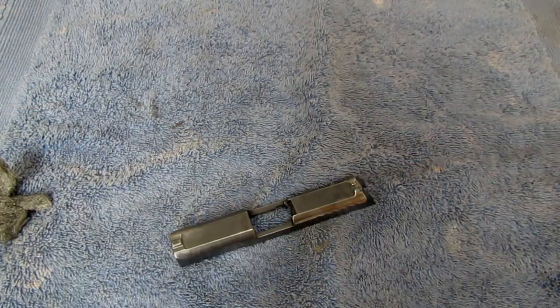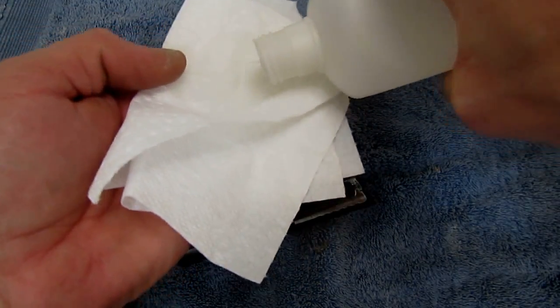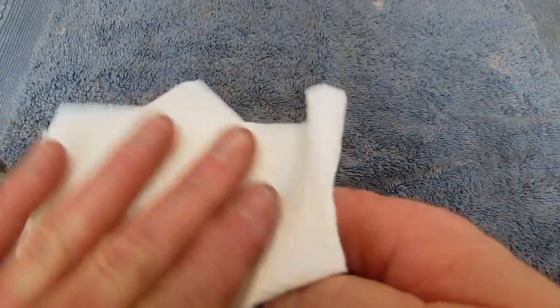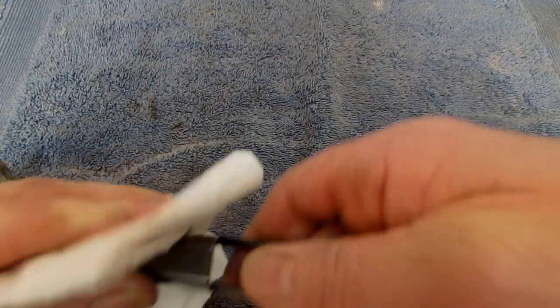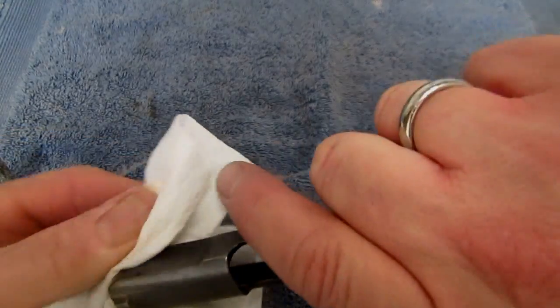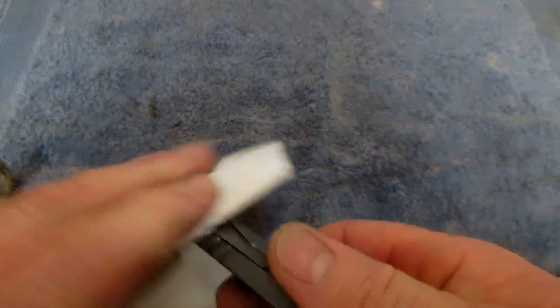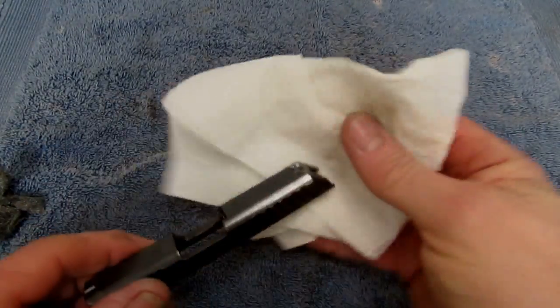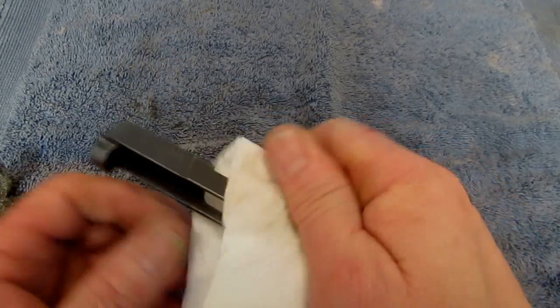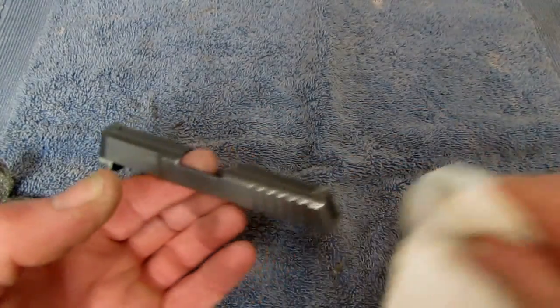Now we're going to take some acetone and a paper towel and do the rest of this slide, just to make sure I get an even bite with the chemicals into the surface of this gun. I should probably be wearing gloves for that same reason, but I'm not. Okay,